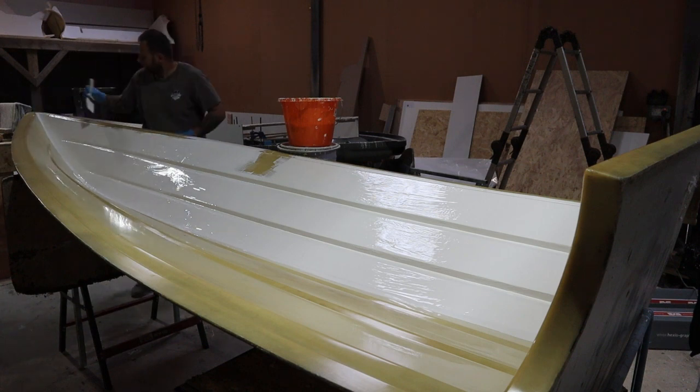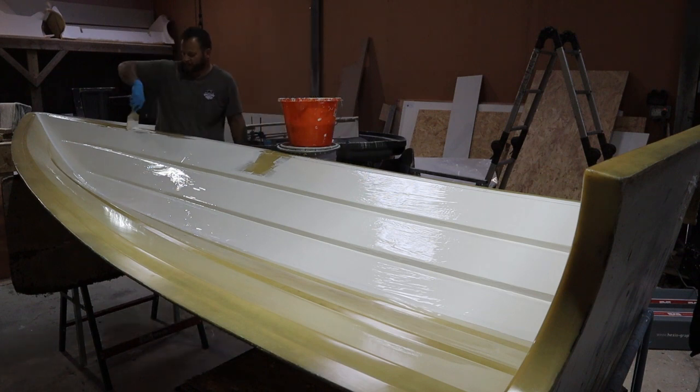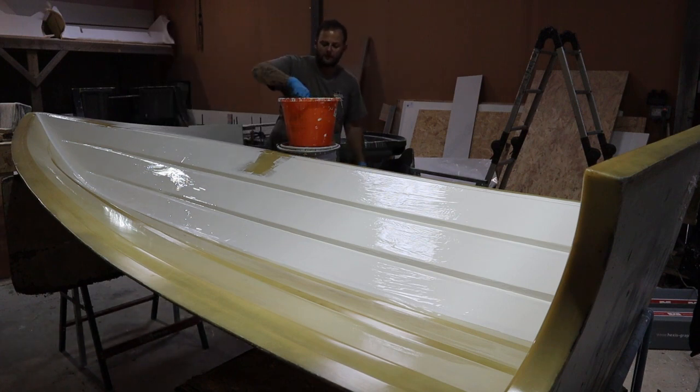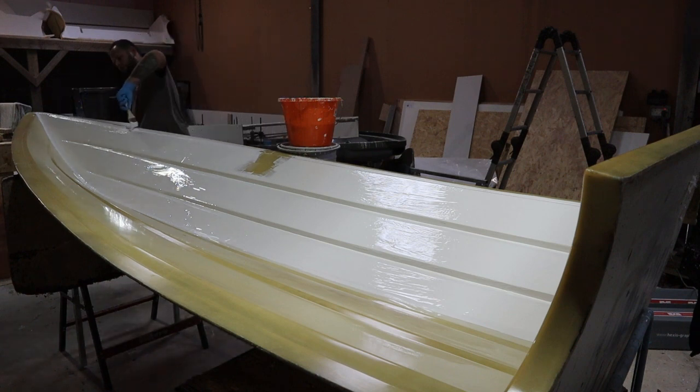So what you need to do, it doesn't take much, even if it's a fan. Once you're finished, a lot of guys use a compressor with an airline on it, just blowing into the mould, and that way you blow all the styrene out into the atmosphere, or the rest of the floor, and it will cure the gel coat quicker that's in the base of the mould.